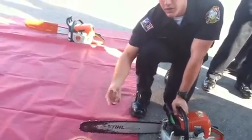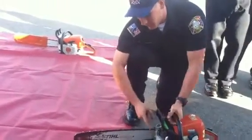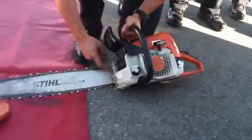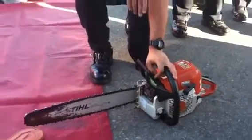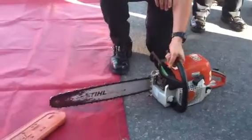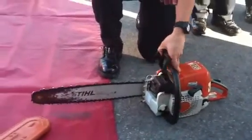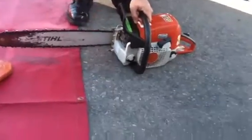The main purpose of all this is to drive, cut, guide, and lubricate — those are four main things. If you work your way back, that's your bumper spike, which is used in the logging industry — something the fire academy really won't be dealing with. This is your front handle guard, your rear handle, and your front handle. The front handle guard not only serves as a front handle but it's also your chain brake. Right below it is your muffler.